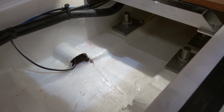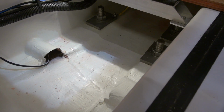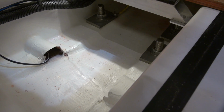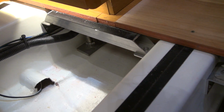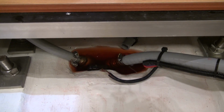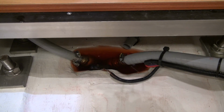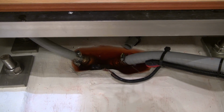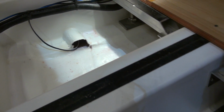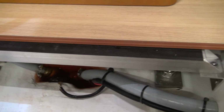The keel bolts on the boat are substantial, have plenty of thread, and big 3/8" backing plates made from stainless steel. The boat has a sump, and you'll see some non-toxic antifreeze in there for winterization. So here we see the bilge pump and the manual bilge pump going into the sump. The bilges are deep enough to allow water to sit in the bilge as opposed to coming up onto the floor or the cabin sole when the boat is heeling over.